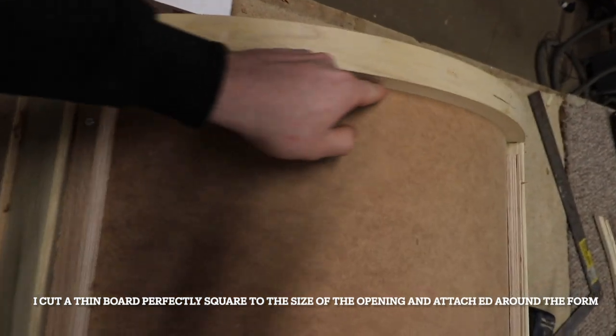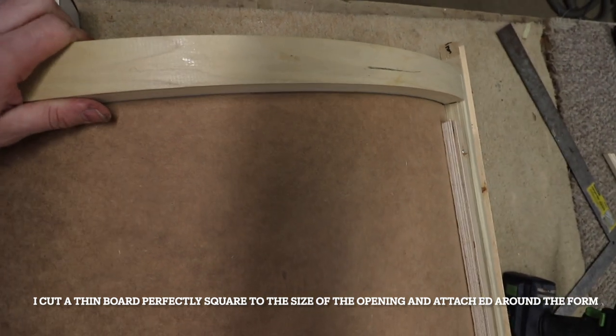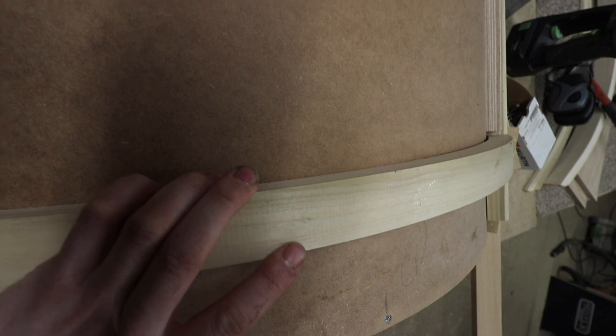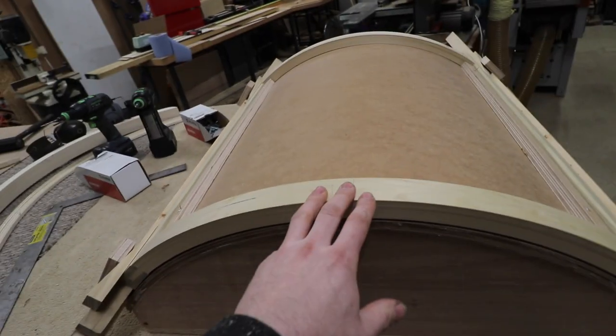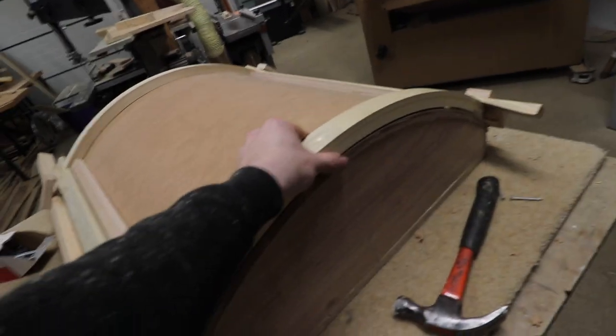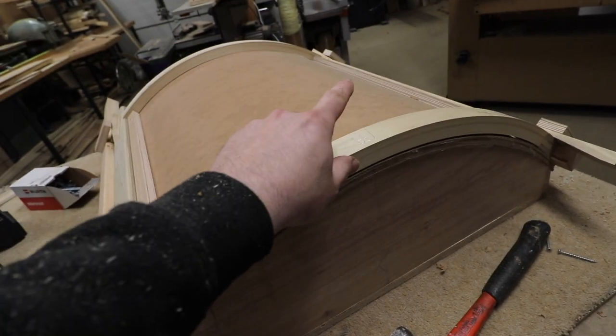That should give me a good reference here for a square top rail. I can tell if it's raised or, you know, slightly out of cant. That should be a good reference to keep it square, and likewise the bottom rail as well. I've got wedges in the four corners at the joint positions to hold it down to the former. I'm going to put a clamp with a batten across the top down to the bench to stop the middle springing up, so when I drive the folding wedges in to tighten the joints up, it's obviously going to try and spring out in the middle.